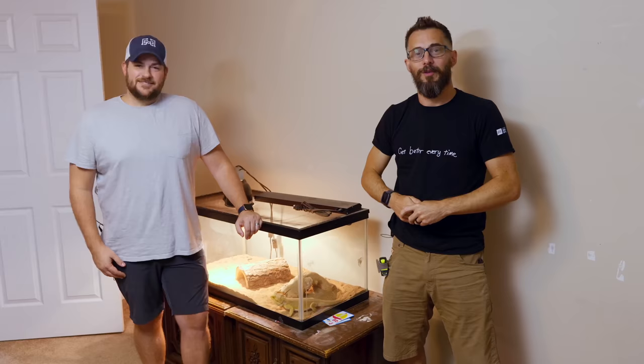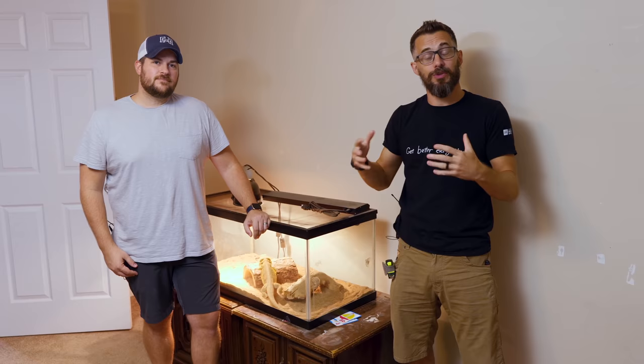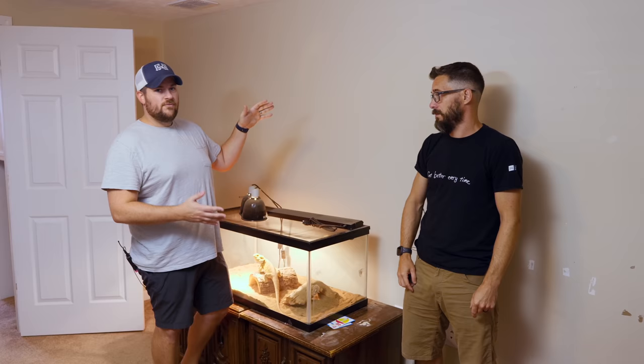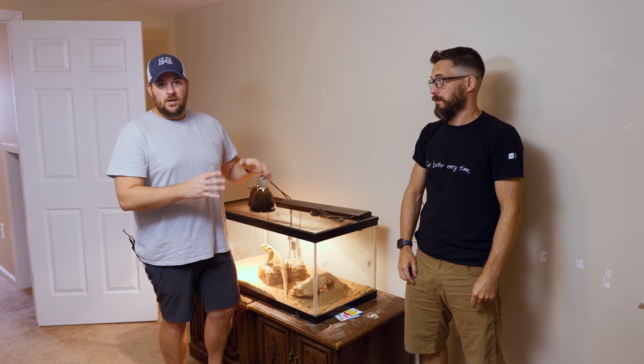We came up with a couple of ideas on how to get some natural looking light down here. What's the plan? Because this is a non-load bearing wall, this is a finished basement, we're able to punch into the wall and we're gonna add some 2x4 flat panel light boxes. And inside those light boxes, we'll dress it up, make it look like windows that we can dim on and dim off to make it look like daytime.